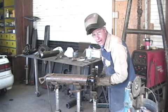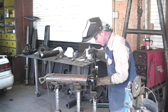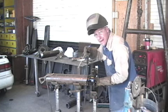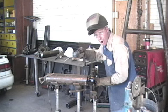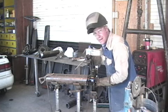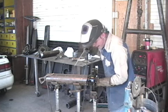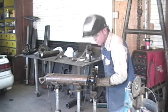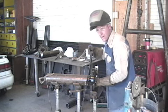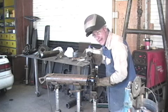I always wear safety glasses, which helps a great deal, but when you put this hood down, you can still see the activity where you're fixing to strike up your arc on your piece. And instead of putting your hood down like that, and I put that in that e-book that you got, when you throw your head down, your hand wants to pull your body off. I mean, I'm exaggerating, but it does pull your body off position slightly.